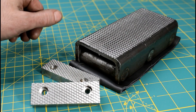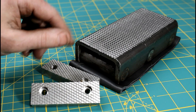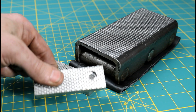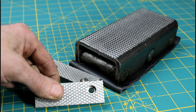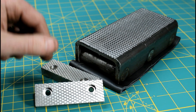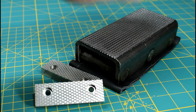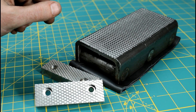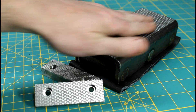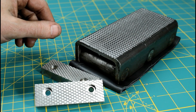Well guys, there you have it — tool shape, spacing, and your angle, and you can get about anything you want. We've got a square pattern here, and here's a little diamond pattern. These are some little aluminum vise jaws I made up just to not mar up sensitive surfaces in the vise. I can't wait to use these machine rollers — I know that next time I use them I'll be moving a big machine in the shop. I can't imagine knurling this would make the situation worse; I think it could only make it better.